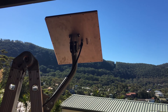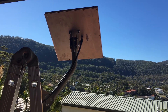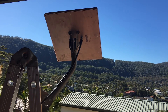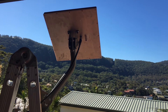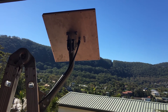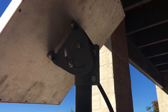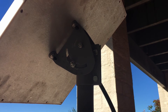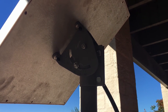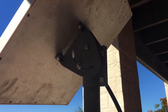Once you know where the antenna needs to be installed, it gets mounted on its bracket and pointed more or less in the direction it needs to go. I've used some landmarks and know roughly which direction it needs to be pointing. I've then used the bracket to set the elevation to roughly 49 degrees, so I know that's going to be pretty close to the final position.